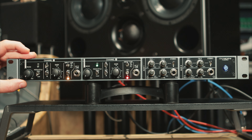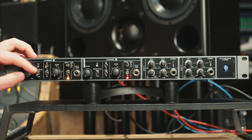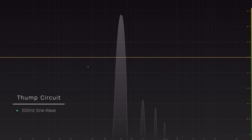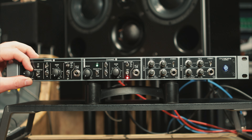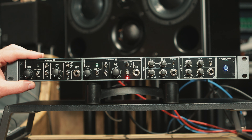The next thing I want to talk about is the mojo section. This is what really sets this mic pre apart from anything else. The mojo section adds harmonics and you have two different circuits that you can pick from: the thump or the cream circuit. The thump circuit is really great for things that have quite a thick tonal quality to them, and if you want to bolster it by adding more low frequencies then this is a really great way to do that. You switch it on with the switch and then blend in how much you'd like to add. With thump it's really useful on things like kick drums, bass guitars, or if you want to add a bit of thickness to the human voice.